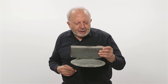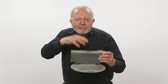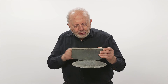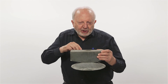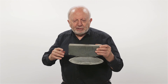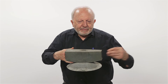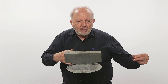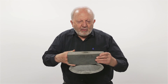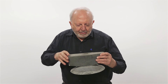When it gets into the ceiling space or roof space, if there's any draft, there's a risk of the air blowing back down and the vent not working. So what this one has is a tube across the top, inside which is a little pivoting V-shape. If the wind in the roof space is going into one side, it will close the V on one side and open on the other, and the air is sucked out. The pitot tube effect means that passing air will suck the air out, so whichever way the wind is blowing in the roof, it will still be sucking air out from the rim below.